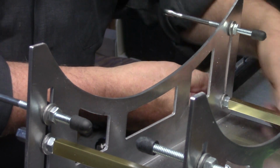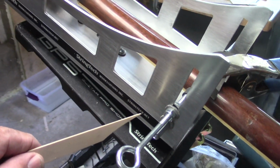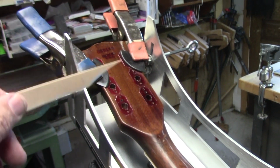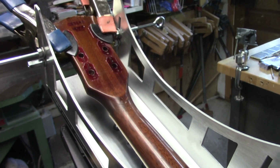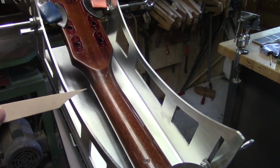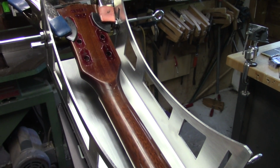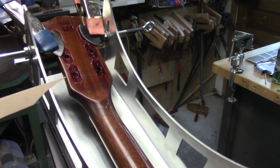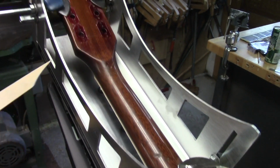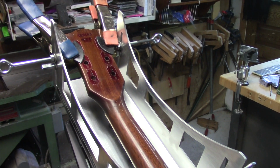I'm going to loosen it off a little bit. And it also pivots. So the second purpose for these stringers here and here is to adjust the tension of the router sled so it moves without any apparent stiffness or looseness. Because it's a channel, the walls on either side are slightly flexible. So you adjust the tension on the support stringers, top and bottom, so that the router sled moves smoothly along its arc.